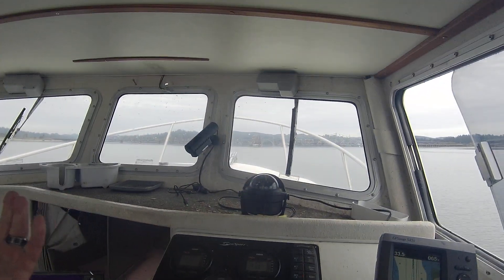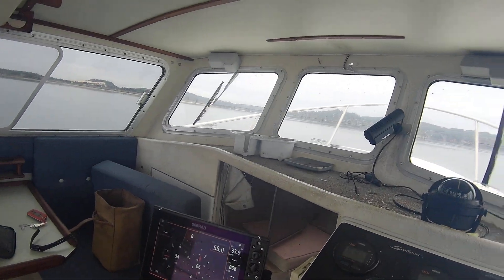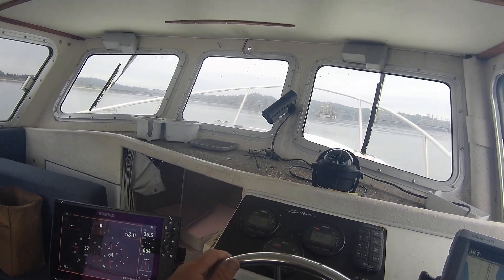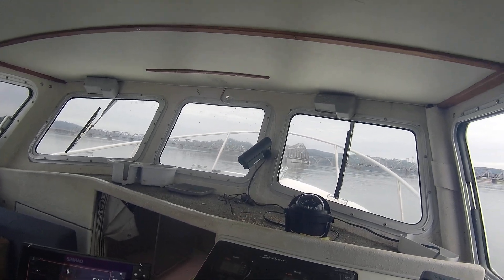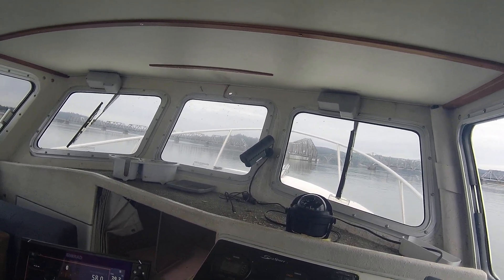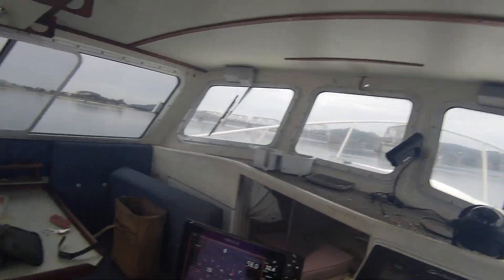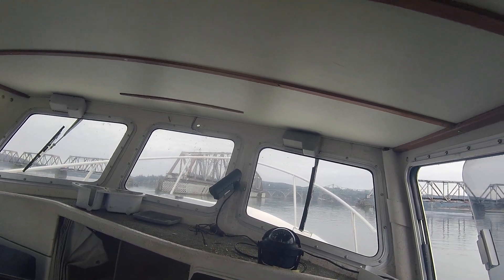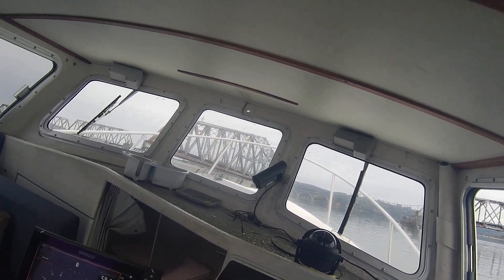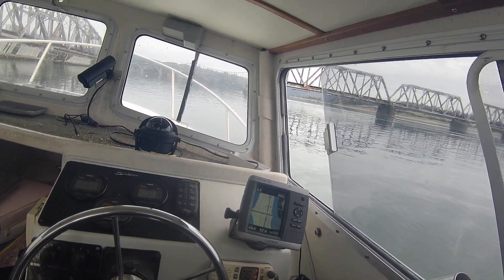See how it's going to 33. Full throttle — it just barely hits the rev. Trimmed up, it does go up to 6,000 RPM, and I can get 6,000 on both motors. Trim down — it's real quiet. Then we'll go down, trim the tabs up. Make sure these are down. I'm going to shut off the starboard motor and trim it up.